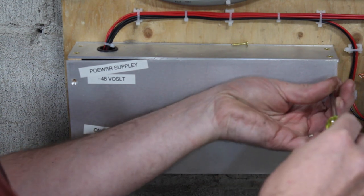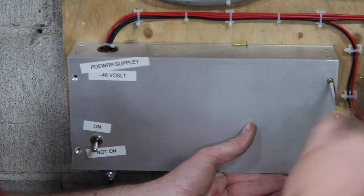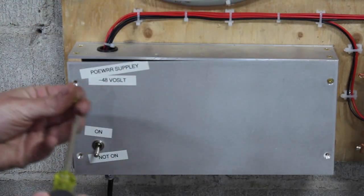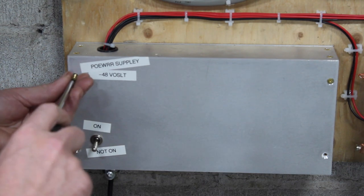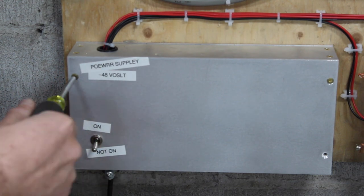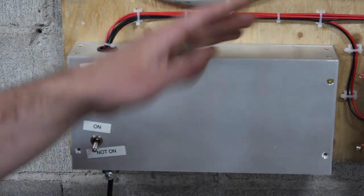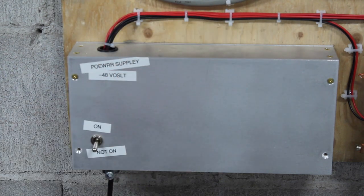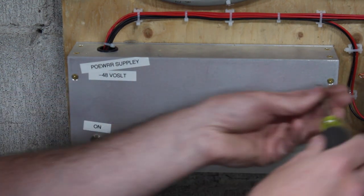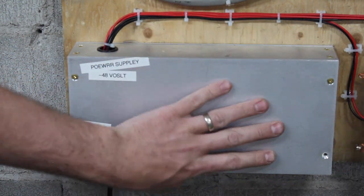And that experiment is, I picked up some industrial control stuff at the scrapyard. And I noticed that there were a couple big solid-state relays inside. This thing had some kind of temporary CSA approval, so it had been inspected, I'm assuming, some kind. But anyway, it was relying on just the surface area of the sealed enclosure to dissipate the heat. So this thing is an aluminum enclosure. This is 1/8-inch aluminum front, back, sides, and bottom. The back stuck against the wood. But I'm hoping there's enough surface area that just the passive cooling will be enough. The fan will still run, it'll just circulate the air inside the box to all this surface, which will help dissipate that heat.